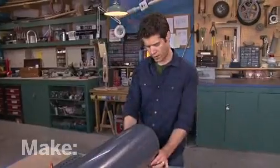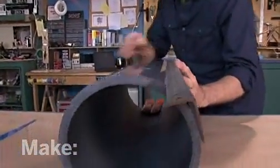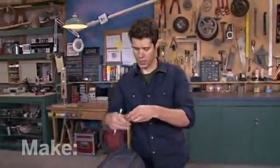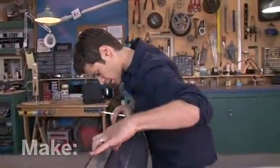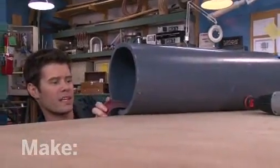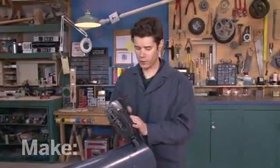The first thing I'm going to do is prepare this for cutting. I'm going to clamp it to my workbench so it doesn't roll around. Here's a really cool trick: I'm going to take an angle iron and set it on the pipe to create a nice straight line. I'll measure five and a quarter inches and create three lines for my cuts. If you press the angle iron on firmly, you're guaranteed to get a parallel line. I'm clamping it down with some C-clamps and cutting it with a saber saw using a medium-fine blade. Take your time — this is heavy-duty plastic, so it'll be slow going. Don't forget your safety glasses, and I wouldn't wear your best clothes because this is going to kick up some dust.